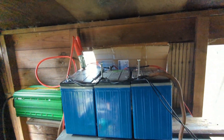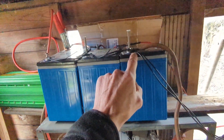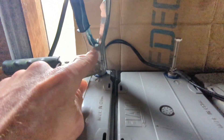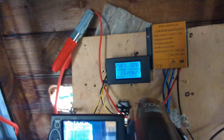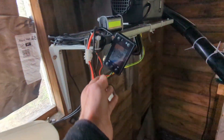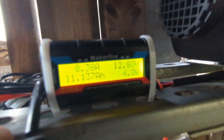Greetings YouTube, 23rd of February. I'm still running with the six batteries — three in parallel and three in parallel — and the packs are connected from here to here. The power from the turbine and the meter is here, that's for the inverter. Power coming in from the turbine is here from the meter, the negative and the positive there. If it gets really windy I just need to connect that to this battery. Got the meter down here with the budget controller which is working quite well. I'm just going to turn my diesel heater on — that'll start pulling about 100 watts.